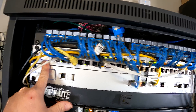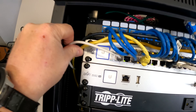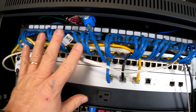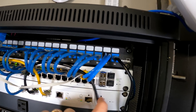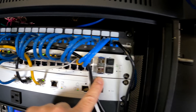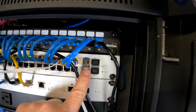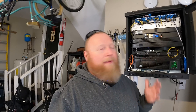The next thing in the rack is our UniFi Switch 48 750W — 48 ports of PoE including 24-volt passive, which is handy for some of the older UniFi equipment. The big thing is it has two SFP+ ports, giving me the ability to run 10-gigabit connections. I've gone ahead and populated it with two 10-gigabit SFPs. Those 10-gigabit fiber SFPs are really the driving factor behind the entire project I'm doing today.